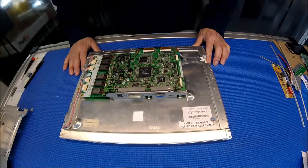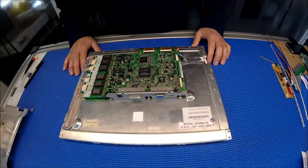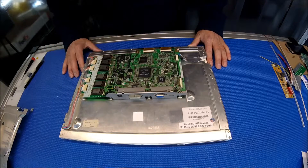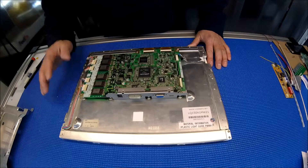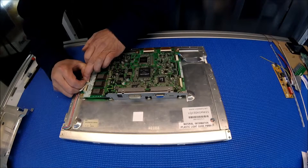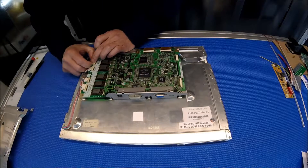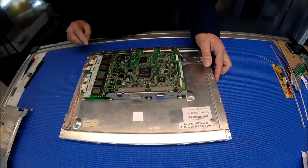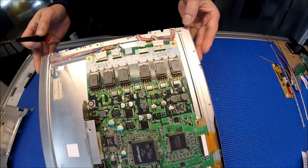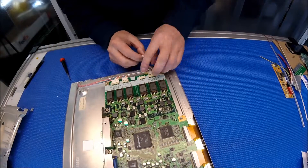This is a pretty common, popular one used in CNC machinery. In order to upgrade it from CCFL to LED kit, it's quite simple for this particular screen. First, you disconnect the backlight connectors. Second, you're going to remove the screws — one on each end.